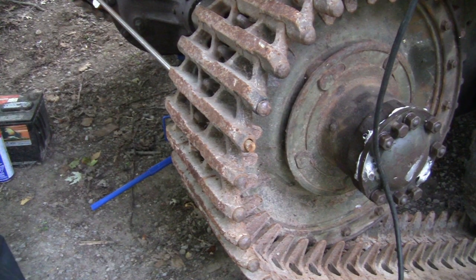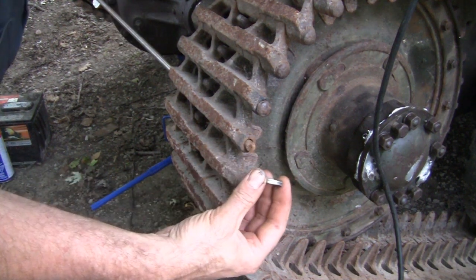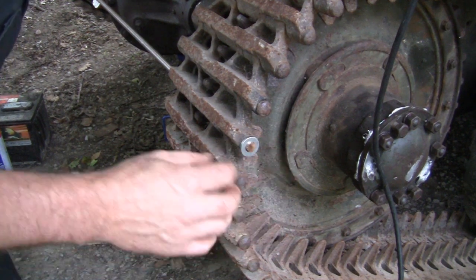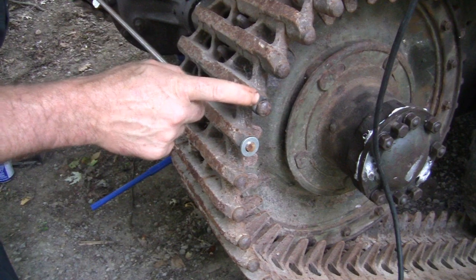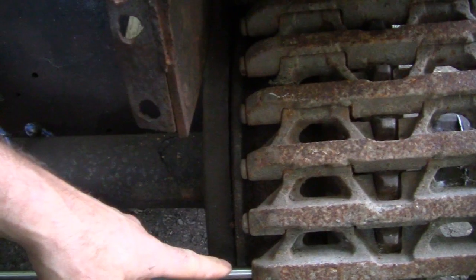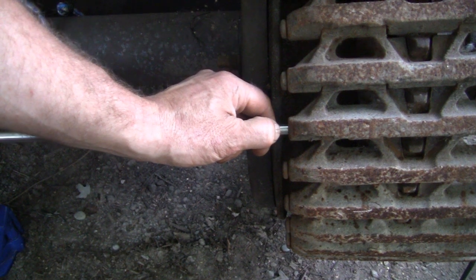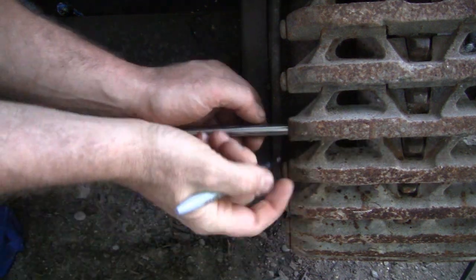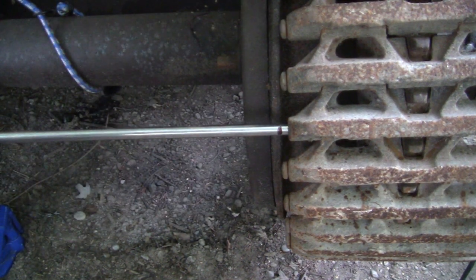So since there's a lot of information on YouTube about all this stuff, I'm going to do it right or wrong, I don't care - leave your comment down there. I'm going to use two washers and put the thick side in. I'm going to weld that on there like that, and maybe tack it in there just so it's stronger. There's not a lot of weight pressure on it, but you can see there is play, there is a gap. So on the other side, I'm going to make sure when I cut it off I leave enough room. I'm going to cut it off in here somewhere - don't want it too long, don't want it too short. Right about there. Now we'll have two more washers on there and then that track pin will be done.